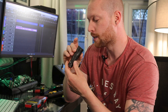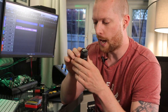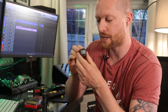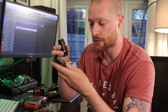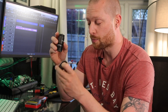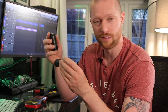What you'll have to do is take the XLR out and then get this old capsule out of the metal piece. There's a little nut which we're going to unscrew. I'm going to try and take it apart and probably just hammer it out to protect the metal shell. I'm going to spray paint this so I can tell which one it is — I've got another Stagg SDM70 I'm going to do some stuff with. I'll try to get the capsule out, then silicon the transformer in with cables sticking out the ends today, spray paint it tomorrow, and wire it all up the day after — quite long-winded but it'll be fun.